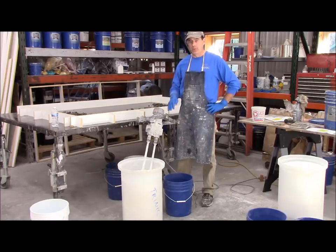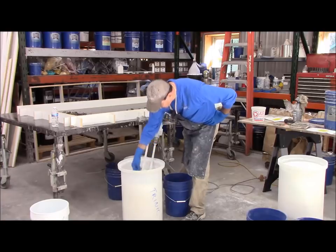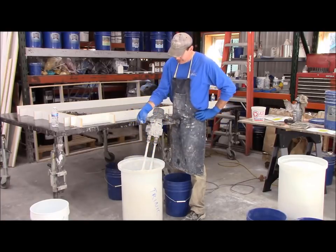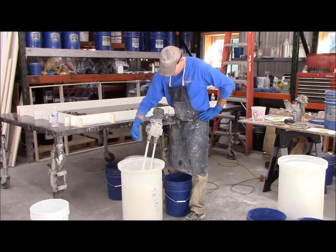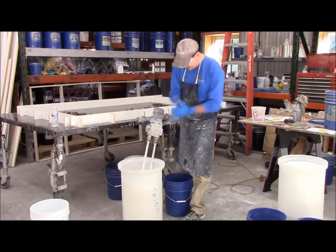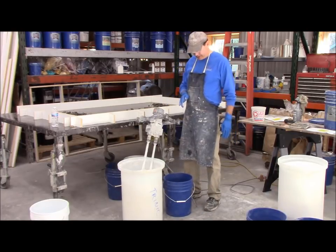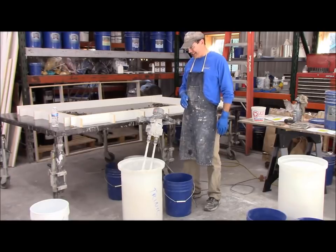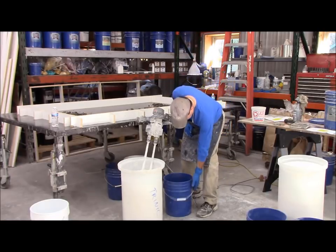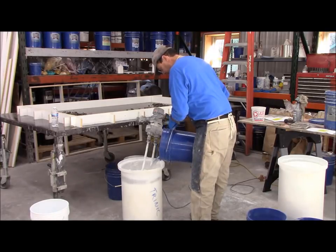If you added all the water and plasticizer at one time, if, for instance, this is a little piece of silica fume, what'll happen is that'll float and it'll escape as you're mixing. It breaks up really easy in a tighter mix. So I'm ready with my face coat. I'm gonna mix this, add 80 to 90% of the water, just guess. Take some out, add plasticizer, see what happens.